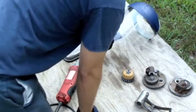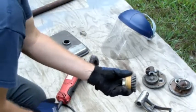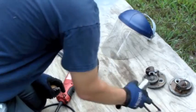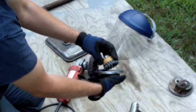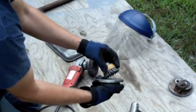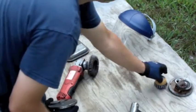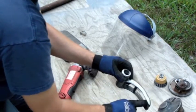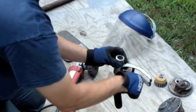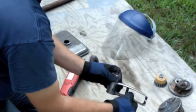I'm back at cleaning these parts. I was using the wire wheel cup because I was able to get into some of these spots, get in really close around here and clean these edges up, which I can't do with the bristle disc. I was able to clean a lot more of this up, but I still can't get in there. I'm going to have to get a really small wire brush on a die grinder and do that.